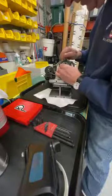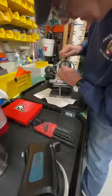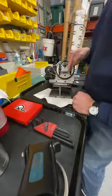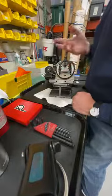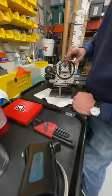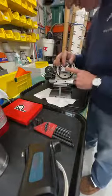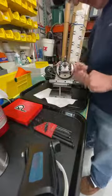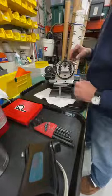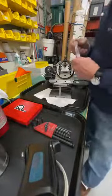And there's a lot of ways to do this, and all I need is some pressure, because once the bit is being pushed into the V-block, it's not doing anything precise. It's just adding pressure. So I actually like the plastic for that purpose. And then I double-check to make sure that I'm going to be offsetting it in the direction I want to offset it, for the direction I'm cutting it.